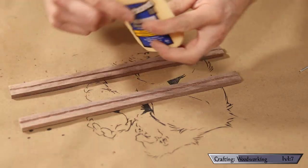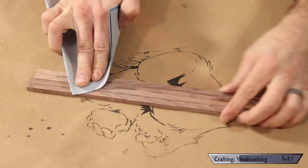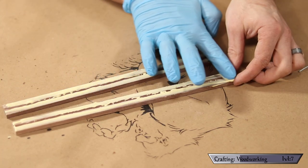At this point, with them together like this, I can see all the way through to the other side, so I think this is ready to be glued up. For this glue-up I've decided to use Titebond 2 wood glue. To help the glue stick I roughed up both sides with 60-grit sandpaper, apply a good amount of glue to both sides, and make sure you evenly spread it.